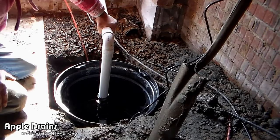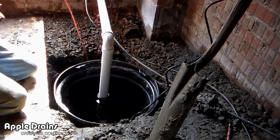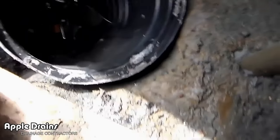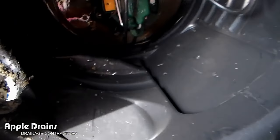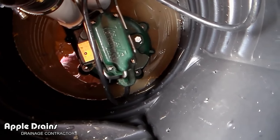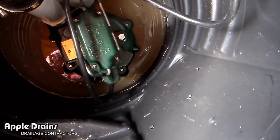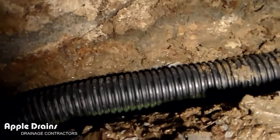Push and hold — that pump's ready to go. We just need to put our lid on and then we'll install the footer tiles with the gravel that will lead into the pit. You can see water is already coming down in that pit. The water is already filling up slowly but surely. Most of the water ran out the other direction, which is fine — there are two sump pumps. This pit is perforated so water can easily come in through the sides as well as through the footer tile. We've got a basic layer of gravel down underneath the pipe.